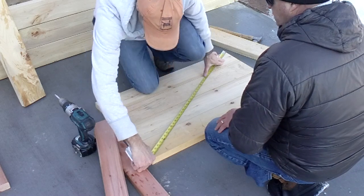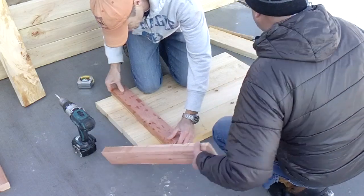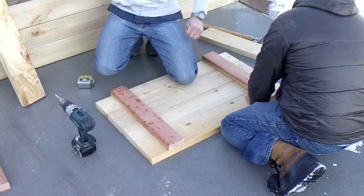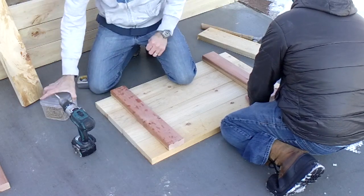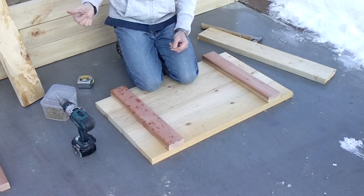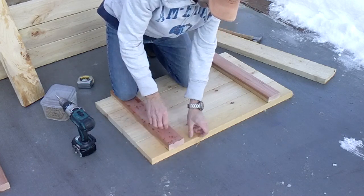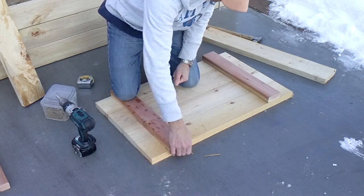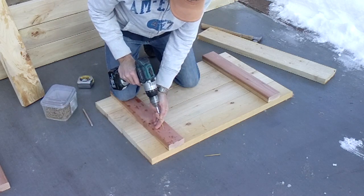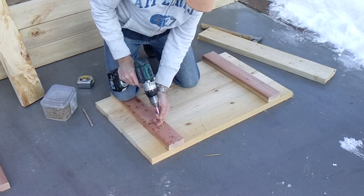We're just over forty-one and three-quarters, so this is square now. We'll put our boards onto our marks and then attach with screws. If you're using the same three-inch screws that you used to put the rest of the shed together, you're going to need to put them in at a slight angle so that the head doesn't sink through and pop out the other side — you'd be scratching your hands all summer long. Put them through at just a slight angle and it'll keep them from showing through on the other side when you're using it.